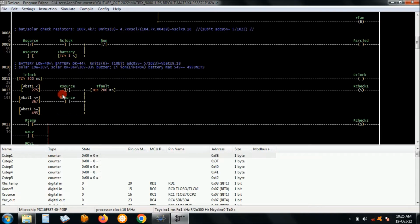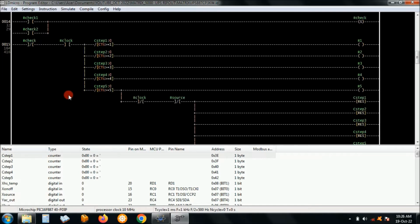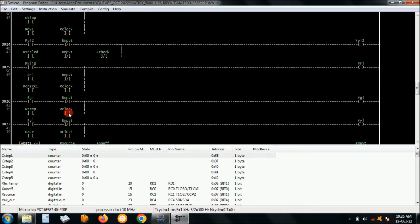And actually the way this control module is mounted, they are charging up to 53 volts. The default is actually solar. When you power the module, it goes to default of solar, so you have to change for the battery manually. Right, okay, these are the testing, and this is just meter indication for the state of the supply. Right, okay, so the LEDs are having two functions, for metering and for state indication, and also fault indication.